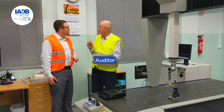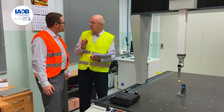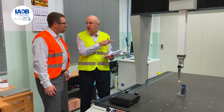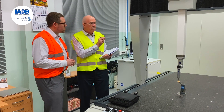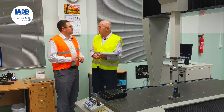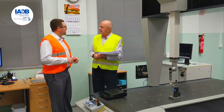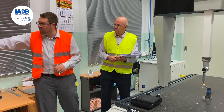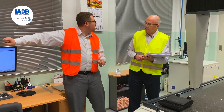Following the audit trail from the shop floor, the auditor notes that a final inspection is done on this product — one part is taken every batch and checked on the CMM. The auditor asks about CMM calibration. The CMM machine itself is calibrated once a year, but every morning at the start of shift they use a calibration ball, run the test, and it feeds into the computer, flagging any errors with the MSA.